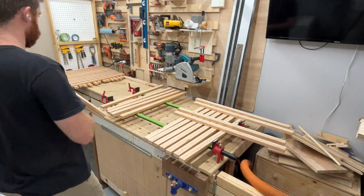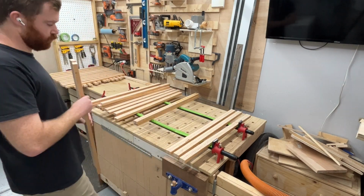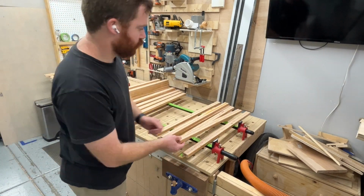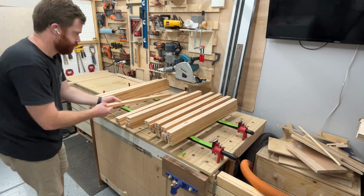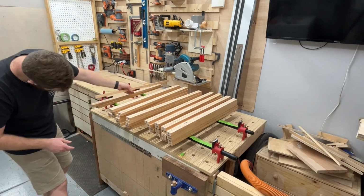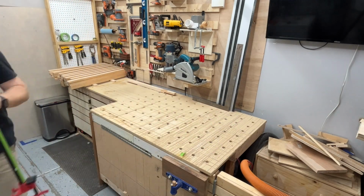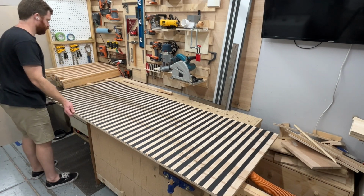And I ended up spacing them out so that they could dry a little better. And I actually ended up numbering them when I laid them out so that I could put them back in the same order, just in the off chance that some were slightly bigger than the other. I didn't want an eventual misalignment towards the edge of the headboard.